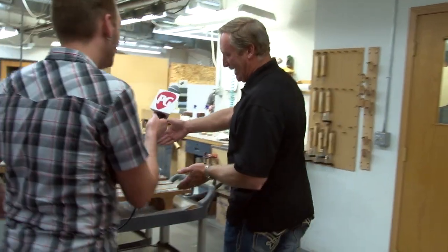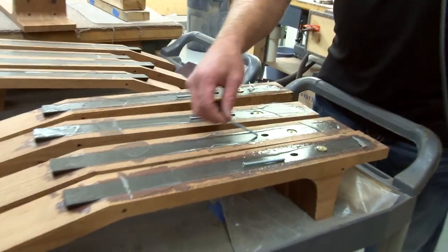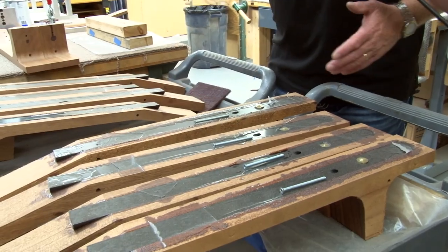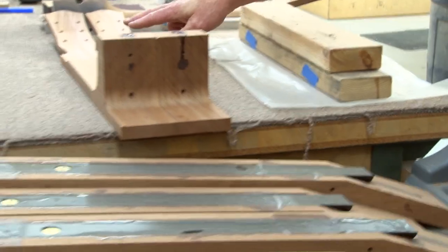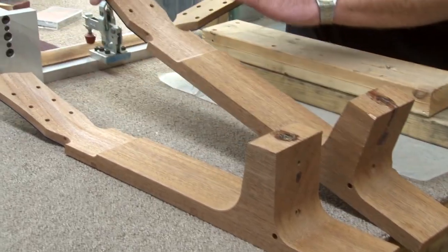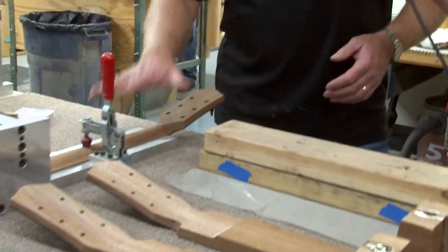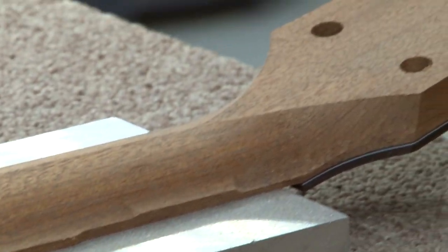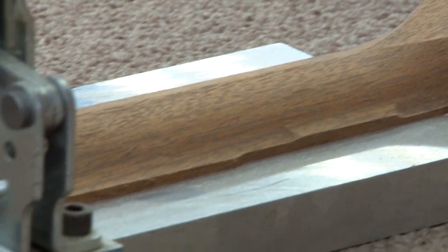It's a unique and expensive system, but I can confidently say our necks are the strongest in the industry as far as stiffness — they never move. From here, you can see we have four necks. This is where Ryan will hand-shape the neck. He's got sanding blocks, files, chisels, whatever he needs. Pretty much all of our necks for the last seven or eight years have been hand-shaped. He also does a dry fit because of our cantilever design. The CNC gets the bulk out as a time saver, then from there fingerboards are put on and Ryan does the shaping for the customer's request.